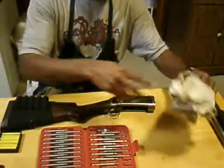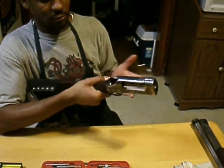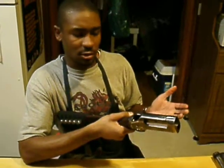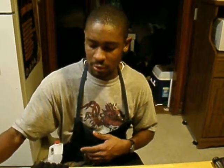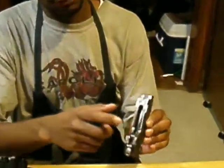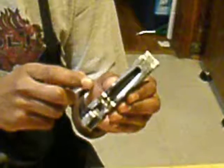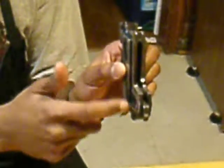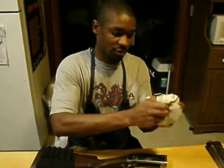From there you can look inside the receiver and look out for any dirt that may accumulate over time, whether it be in storage or after spending some time shooting. If you've shot it a lot, you get a lot of unburnt powder on the carrier. Sometimes you get some on the lower part of the carrier where the locking block hooks up to. The machine cut where the action slide runs through tends to stay relatively clean, depending on storage conditions. It's always good to keep that section greased because the slide actions will be running through that channel whenever you're cycling the action.